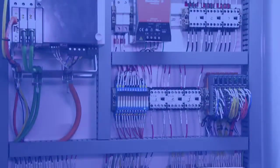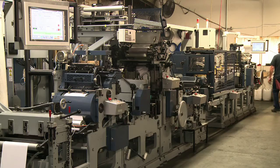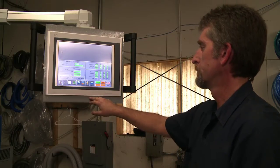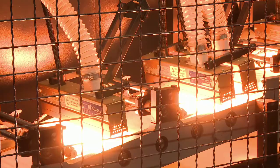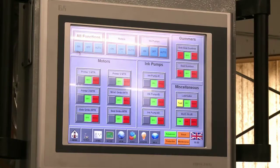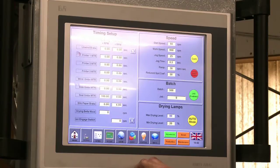Electrical and electronic package. Besides rewiring the machine including a new motor and drive, we've added two new touch screens that centrally control all the functions of the machine, such as heat intensity of the infrared lamps, real-time location of paper jams, counter and batching operations, and access to maintenance and production history.